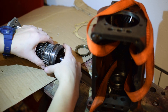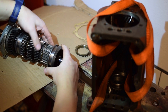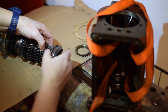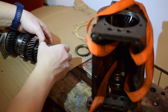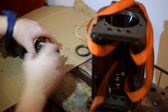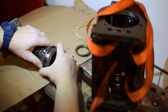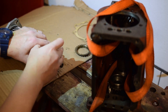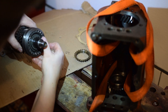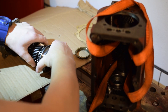It's important that the dogs are going into these depressions on this synchro, and later on with the other synchro as well. If they are going in correctly, then these dogs will be able to go down as far as necessary. We can check that each dog is in the depression correctly — this one is not. We back up a bit and push the dog backwards. Now it's correct.